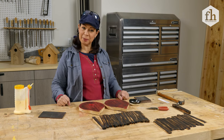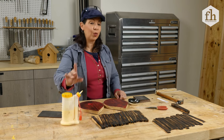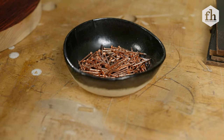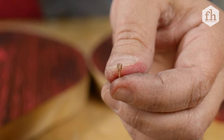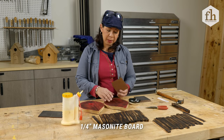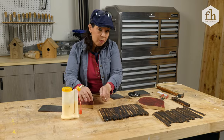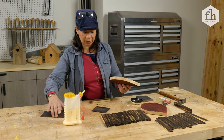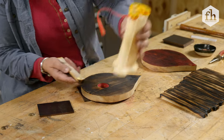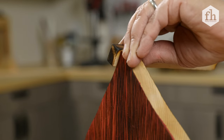We've painted our front and back panels and now we're ready to put it together. We've got exterior-grade glue — by using exterior-grade, we ensure the house stays together longer. I'm also using little copper nails because I think it looks cooler and adds another pop of color. I'm also using quarter-inch pieces of masonite board that I've cut in advance for the overhang on the front. Instead of trying to hold a precise quarter-inch gap, I just let the masonite board do the work. I'll put a little bit of glue on each piece, line it up with the spacer, and nail it in — it automatically gives me the profile I need.